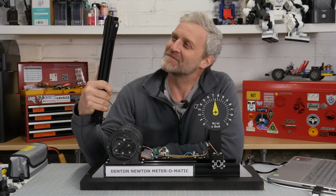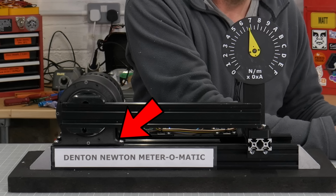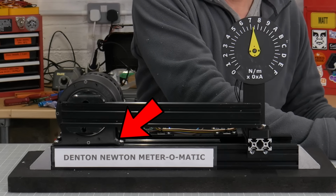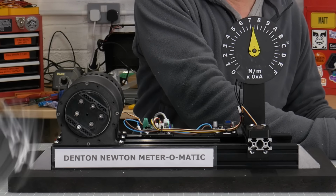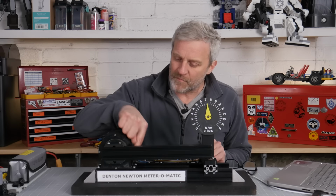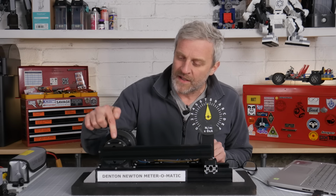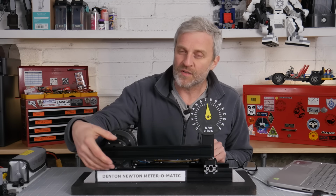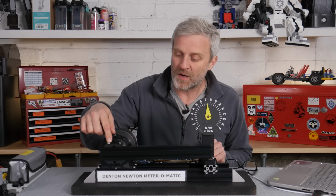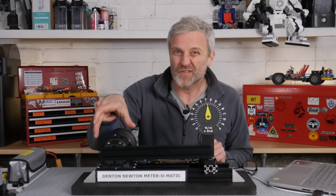Interesting. Reviewing the footage, you can see it's the support that's the first thing to go. 130. Followed shortly by the arm. You can see it starting to split here just before it explodes. Whoa! The front mount is now polycarbonate. The front arm is actually PLA because I think that's that layer line issue, so it's probably got better bonding for that particular part. Polycarbonate because it's tougher to screw down through.